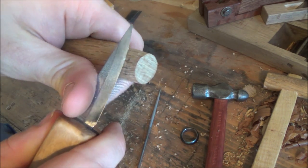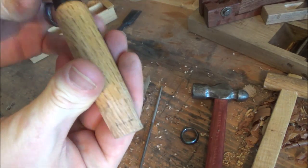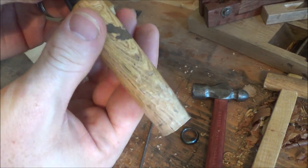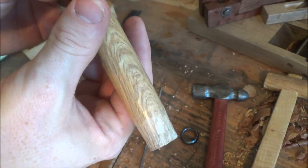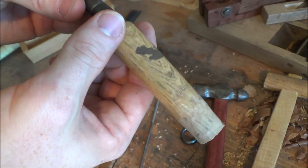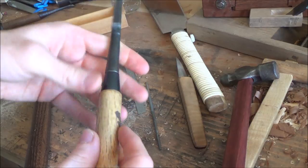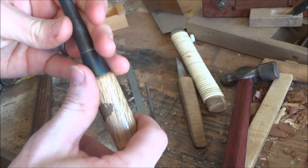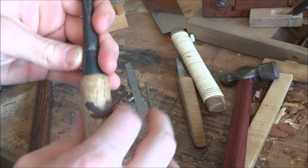As you can see here, we have eliminated the ledge that was left previously. Got some marks there still, but that's okay. The way you check to make sure it's still round is you can do a test fit, but you should spin it in your hands. And if you see any lumps pop up, that's a high spot and that's where you should definitely do some more work. Now one thing I'm going to do on this — it does have some lacquer finish on it — I am just going to go ahead and scrape that off because it feels very tacky in the hand.